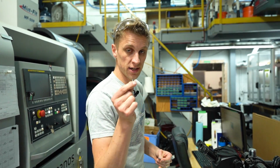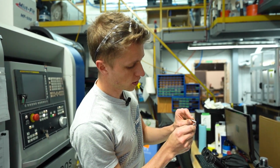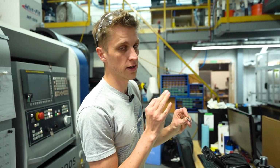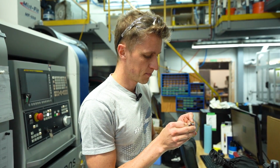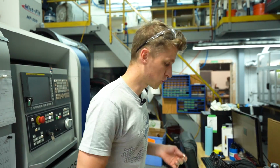Right now I'm inspecting one of the turning inserts on the Swiss lathe. What this guy does is it goes across the material and it turns the diameter and the groove and the radius and everything, and it has to hold an extraordinarily tight tolerance. I'm trying to hit a tenth, the 1/10,000th of an inch or less, on this diameter. And it can do it, but if it wears or if it chips or if it breaks, or if, like an idiot, you jog into the material like I just did and chip it, I'll show you guys what it does.